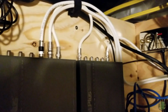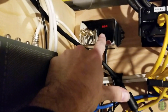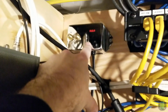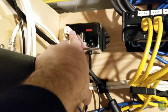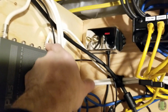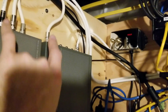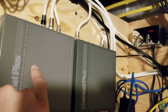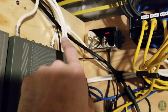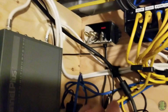And then we go up all my coax. So I had to take the antenna boosters, a 10 decibel booster that I normally run my antenna through, and I was finding that this was creating enough noise just by amplifying everything when it went into here that it would drown out these channels. These would lose reception, which is interesting because the manual for this one states that they recommend you use an inline booster before connecting an antenna to it to meet FCC regulations. But I'm in Canada, so anyway, I had to take this out.